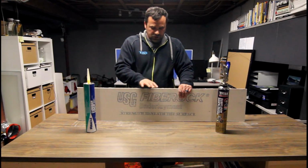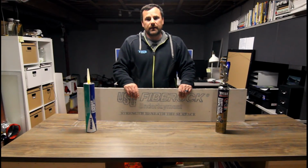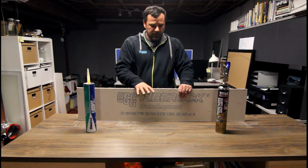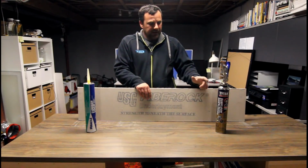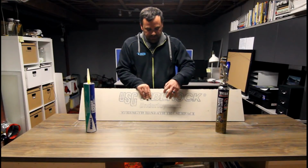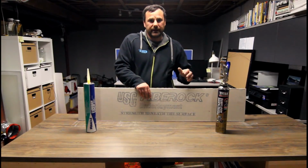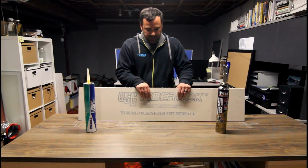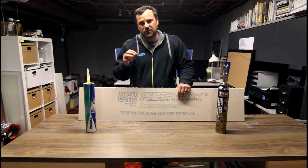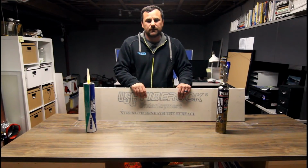So this one I want to try because when you're doing a large square footage, 25 cents a square foot saves you a lot of money, especially over a lot of houses. So we're going to try this, but I just want to feel comfortable with it. And because I'm new to the Tytan product, I also want to make sure that I'm comfortable with this bonding to this, because in this scenario I just want to staple it and glue it down rather than gluing and screwing, or maybe just screwing. Depends how you want to look at it, but I know some installers prefer staples, but I feel like a staple isn't as good as a screw for holding power, so you might as well glue it. So there's a little bit of debate there, and the old hamster cage gets worn out a little bit sometimes.